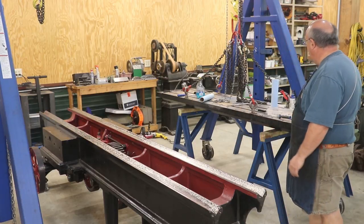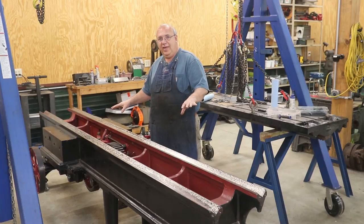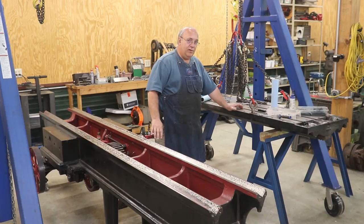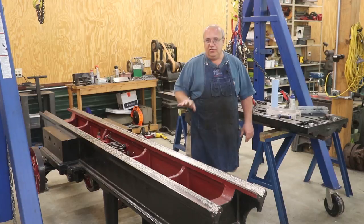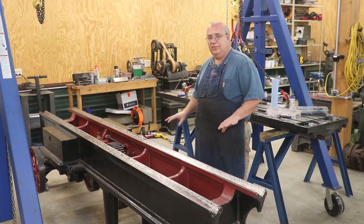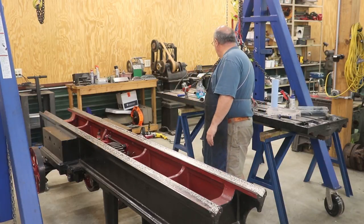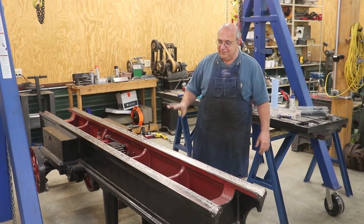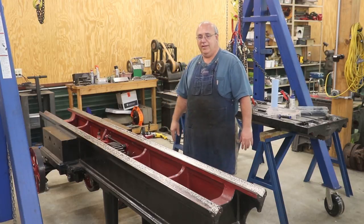Now the table is a different story. It was ground again fully supported, and when this machine is sitting on its ways it is pretty much fully supported, so you don't have those dynamics going on with the individual feet. I am confident that the grind job done on this table is pretty darn good. In fact when we measured it in the shop it was near about perfect and I'm confident it's still in that good of shape. We're going to do some scraping to it and fine-tune it, but I'm not expecting to have to do near the amount of work we had to do to get this base done. So good job on that.